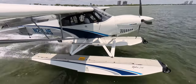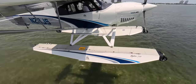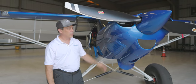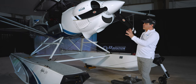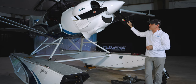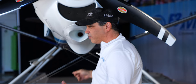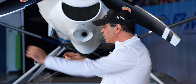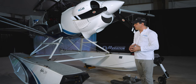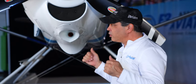This is a composite three-blade prop, and we talked about 215 horsepower. Our last Carbon Cub FX3 was 180 horsepower — big difference in power. Love this engine, love this package. It's fuel-injected with a constant-speed prop so we can adjust that. The exhaust setup is also different; on the FX3 we used to clean carbon out of the drain — we don't have to do that on this plane. There have been a lot of changes to the X-Cub versus the FX series.